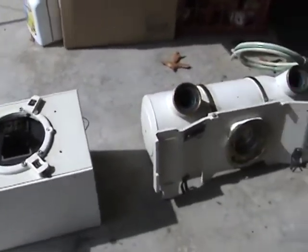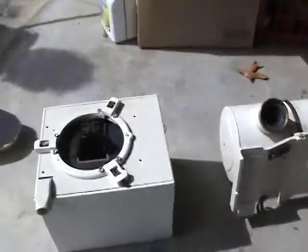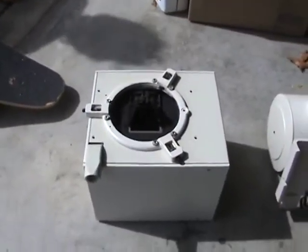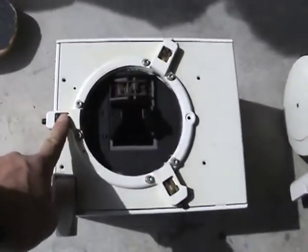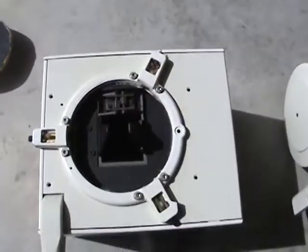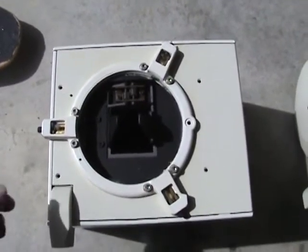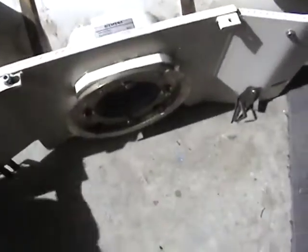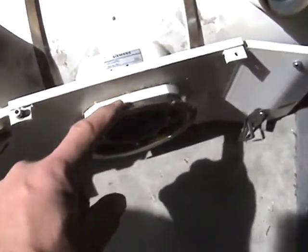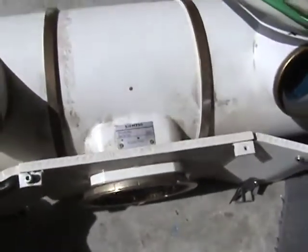Here I am out in my garage workshop. What I've got here is an X-ray tube, and right here is the collimator box that I took off just a moment ago. As you can see, it's got three set screws - basically like hex nuts - and you have to unscrew all three of them. Those things secure to this brass ring right here, which is what allows the collimator to hold on to the tube itself. This is a Siemens tube.